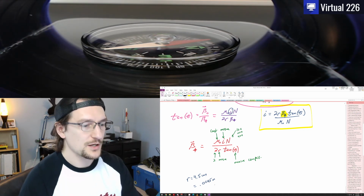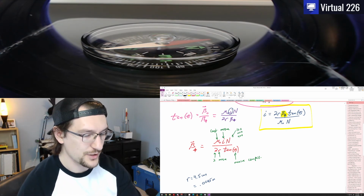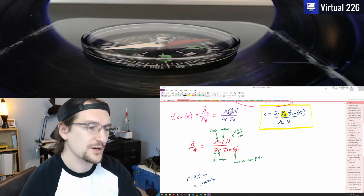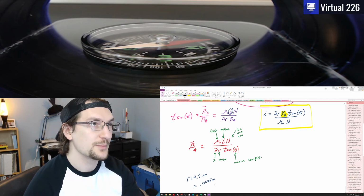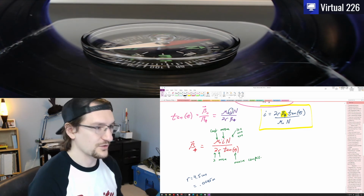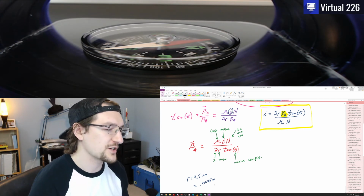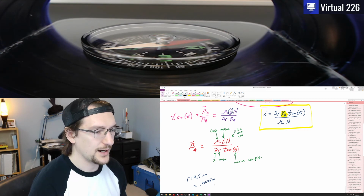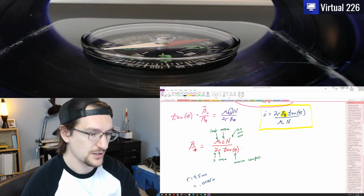So now let's just turn this on at 100, and let's see what we get here in terms of the deflection, because we know that with 200 and 400 we're going to get different values for everything, and the currents are going to change too, because as you have more loops, you have more copper coils, and that means slightly more resistance due to the extra length. So we know this current's going to change slightly as N changes. So let's just run this once and see what we get. Let's just do it for 100 and figure out whatever the current is there, and let's measure an angle.